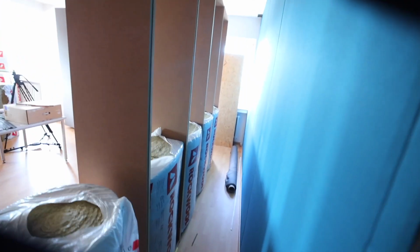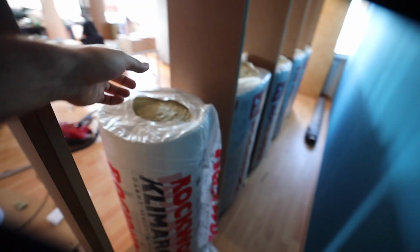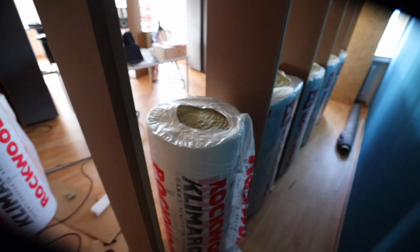And by moving all of these a little to the front, I create this huge space behind here that I won't fill out yet. I will measure first, and if necessary, I can go from 40 centimeters absorption plus 60 plus 30 that are already in here. So a lot of back wall absorption, which is always really important because the sound hits the back wall up front. The side wall is always in an angle, so the sound has to travel through.